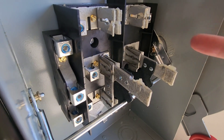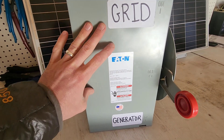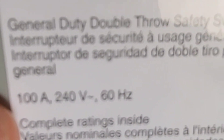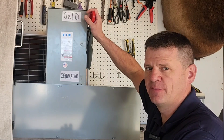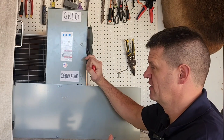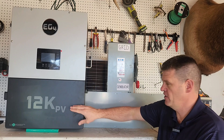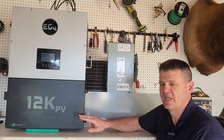You can wire generator to the top if preferred, but I'll keep it as-is. Since all your house power runs through this unit, don't go cheap — avoid knockoffs on Amazon and get a name brand. This one is an Eaton, rated for 100 amps to match my 100-amp service. Running in grid mode alone won't save money on the electric bill. To save money I'll run it in solar generator mode using a solar generator system — the solar generator's output feeds directly into the input of this transfer switch.